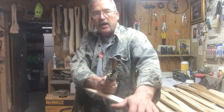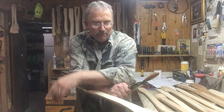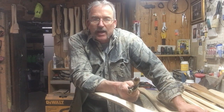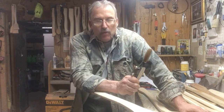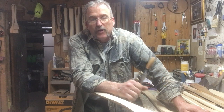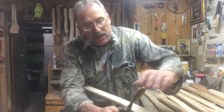One thing I did tell a guy this week - he sent me a picture of some grain in his handle and on the eye it was slanted almost 45 degrees. Typically in most handles I'd say grain that's not oriented perfectly straight is not a good thing. But what I tell people all the time is hickory wood is tough as nails. If you can get away with grain orientation going the wrong direction in any handle wood at all, it would be hickory, because it's very, very tough wood.